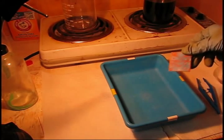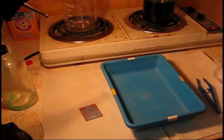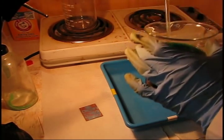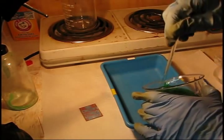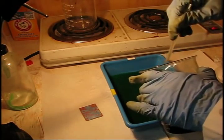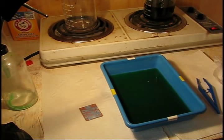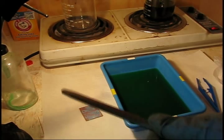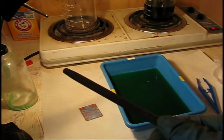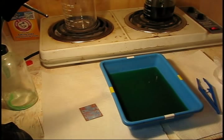Now that you've completed removing the paper from your circuit board, you can take your warm-to-hot etchant — not boiling — and practicing safe precautions with the hot plate, turn it down when you're not using it. Just pour some of that etchant into your plastic tray — you can use glass, but I prefer plastic. Because this etchant is hot it's going to give off acid fumes, so keep any metal objects such as pliers, tools, or components away from it. I'll put a photo in the description of a really corroded chisel I accidentally had lying around here.